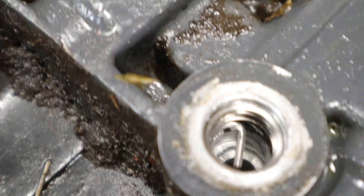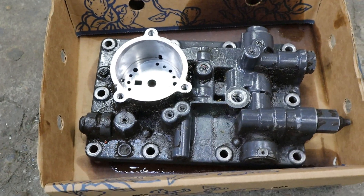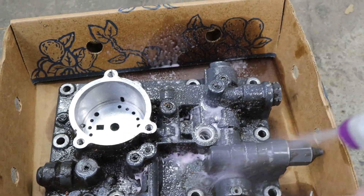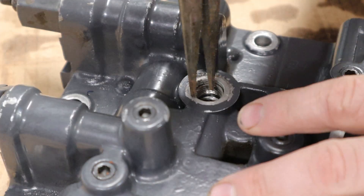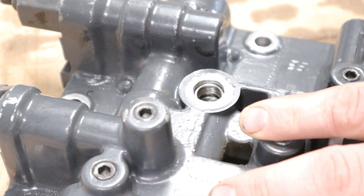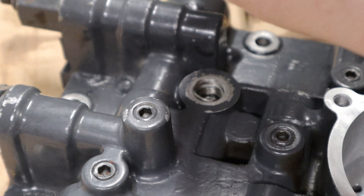So we're going to try to get them back up on the road. The first thing I'm going to do — even though I'm not going to be filling the hole with weld, there's still going to be some welding involved — is spray this thing down with some engine degreaser. Whether we weld the hole up completely or do what we're going to do, in either case we want to remove this whole helicoil and get this all cleaned out.